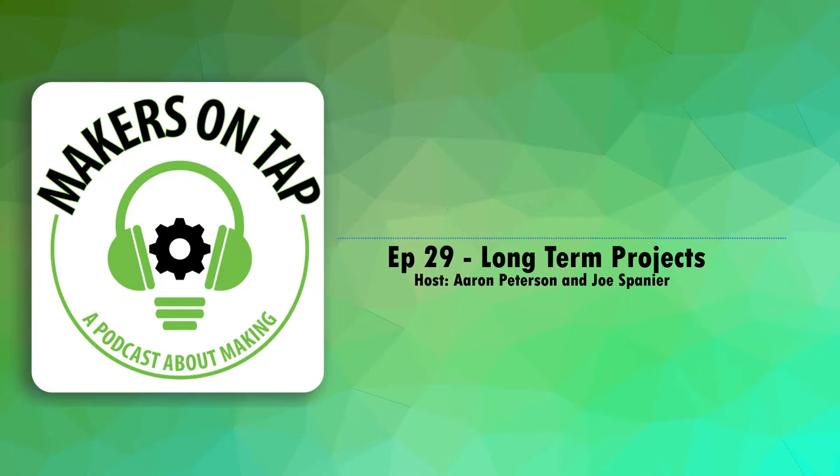So someone wrote a really great how-to on heat set inserts for 3D prints. It's very long actually, but with a lot of great info. For those who don't know what a heat set insert is: it's a little chunk of brass with some teeth on the sides. You make a hole in your 3D print that's appropriately sized, then use a soldering iron to put it in, and you get nice, strong, reliable threads to put bolts into your 3D printed parts. It's kind of like melting a nut inside your print, but especially designed for threads. It's far more effective. We used to do that back in the day — it doesn't work very well.